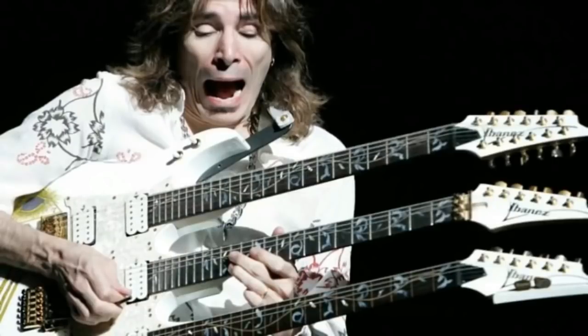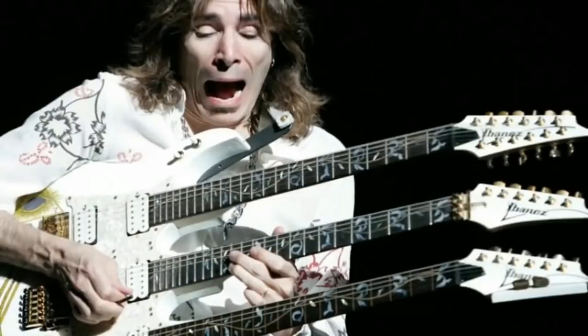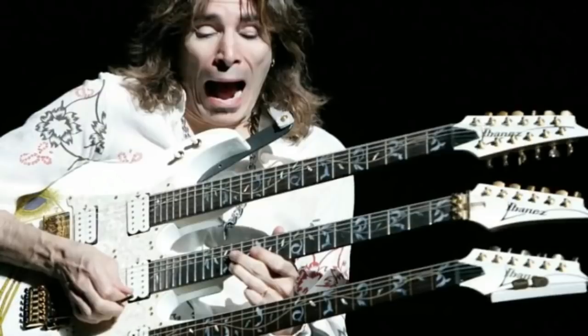So I came up with this idea to split the coil. When I'm in this position I get the full-on humbucker. And in the middle position it turns two pickups on but splits the coil so it's two single coils — so you can get that sort of Strat-y sound. That was unique at the time. Then the same thing here — you split that coil, and then you've got your full humbucker. That was unique at the time.